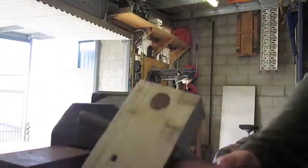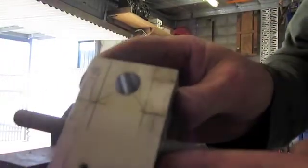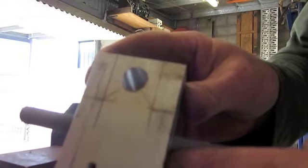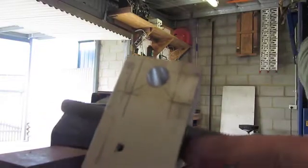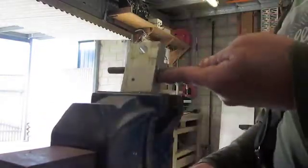Alright, I've got the hole drilled for the all thread, nice and threaded. I've got that drilled out for the rod that operates the raising and lowering of the blade. So these have got to be cut now, so get my hacksaw action going again. I'll cut it out. These little chunks here will be gone, and that'll allow it to clear the pieces on the gearbox.